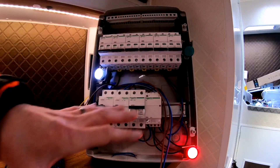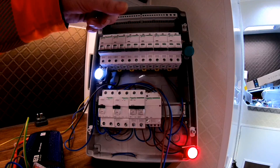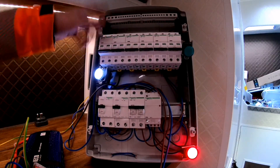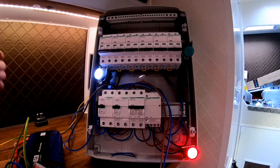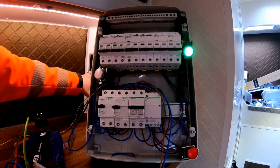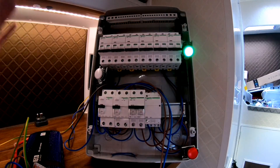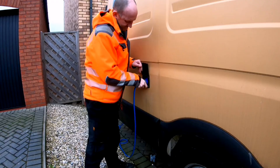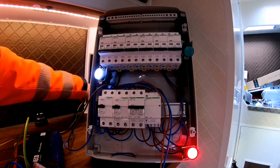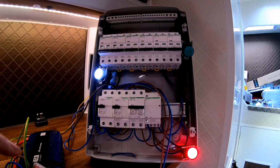The red light is there just to help us indicate it — that would go to the neutral busbar and again be piggybacked into your breakers, so you're switching between your feeds. We'll unplug the shore power and then go back to inverter power. As you can see, it's swapped over nearly instantaneously — so it's not quite an uninterruptible power supply, but it's not far off. Now put your power back on again. Shore power on, relay's gone over, we've gone on to shore power.